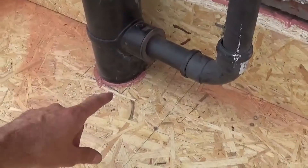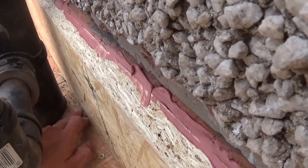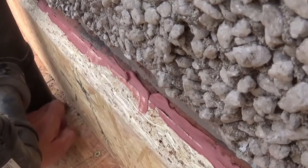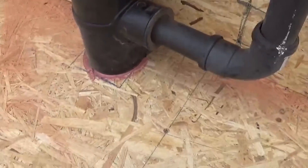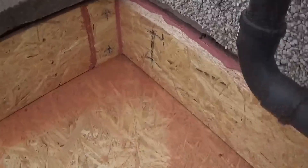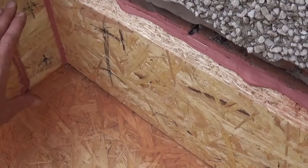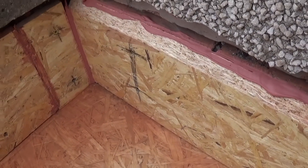We've got a hole here for the soil pipe and we've had to cut around that. If you look around the back, we filled that in with a piece of wood by putting a piece of batten on the back wall between two of the joists, and then putting a piece of OSB board back on top in the shape of the soil pipe, so we can apply the rubber to that and have a nice seal all the way around. When we come to the corners, we've bought some rubber roof patching. Where you put the cuts, you put the patch over the top and stick that down to ensure you've got a nice tight seal.